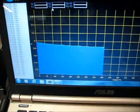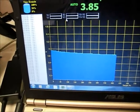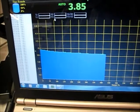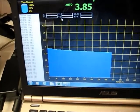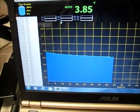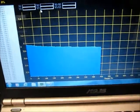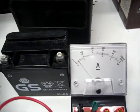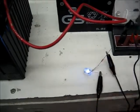We're also graphing this chart. What we want to do is run this out and see what the discharge curve actually looks like — that's very important. I'm only drawing a current of about 4 or 5 milliamps just to see. Here's the LED. I've got it limited because I want to run a C20 curve to see what's going to go on with this cell.